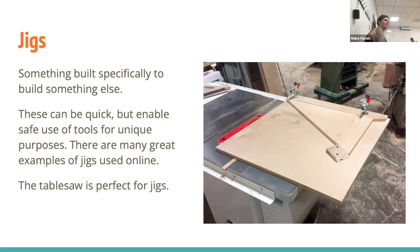You're not alone. Yeah, it looks like that's a stationary piece right there. To get like a 30 degree angle almost on the other side. This piece may come out. Maybe you can put different pieces in there for different angles. And this whole board slides. There's a track right here. So there's a strip that's attached to the bottom of the board and that fits into the slot on the table. Oh, so maybe it's square and it fits in here? Yes. Wow. That's cool.